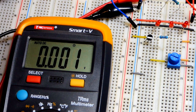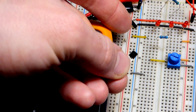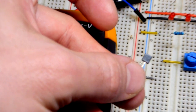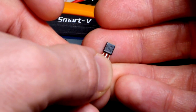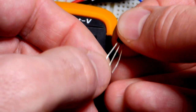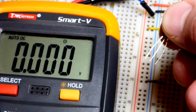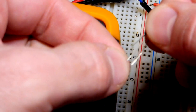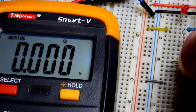We'll lose about 0.7 volts, so about 4.1 volts will ultimately be across the resistor. Here is the PNP transistor — the 2N3906. I measured from the positive rail, not the negative. It has the same pin layout as other 2N transistors: emitter, base, collector. The polarities are different from an NPN though — NPNs are more common. For a PNP, the emitter goes toward the positive rail, so I orient it with emitter up, base in the middle, and collector down.